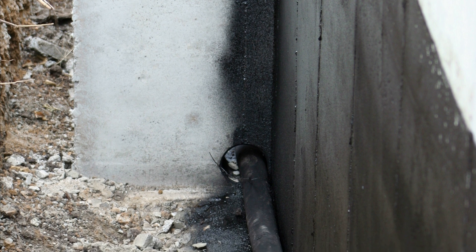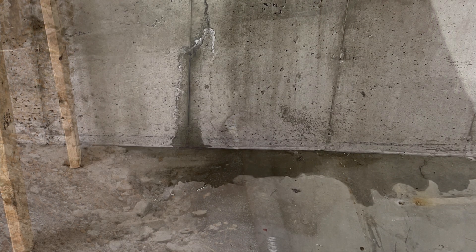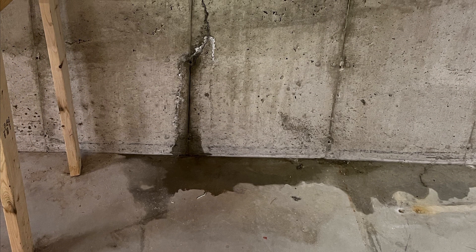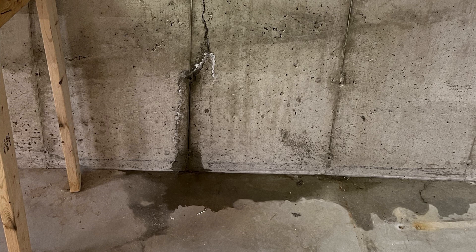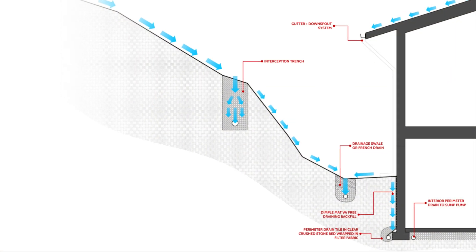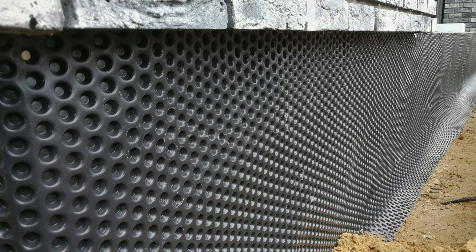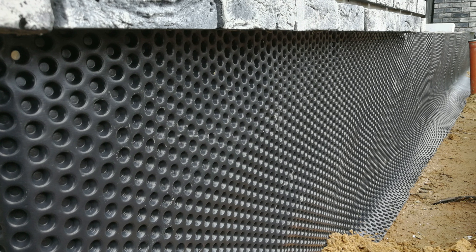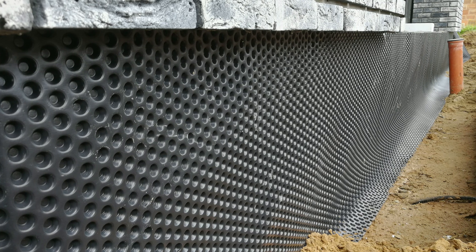If there's one thing that you can do to prevent leaks in your foundation waterproofing system, it's to ensure good drainage. Drainage is the key to a dry and durable foundation. It doesn't matter how good your waterproofing system is — water always wins — and we need a strategy to drain and divert that water away from the foundation. In this video, we're talking about how installing a simple dimple mat may be one of the most important things you can do to keep your home dry, especially if you're building a basement or a conditioned crawl space.